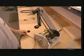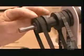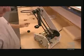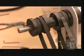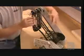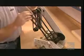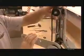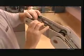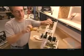At the arm shoulder level, they install a system of 4 pulleys. Each consists of 2 plastic wheels on a separate axle, with a rubber belt running between them like a clothesline. The belt has little teeth that grip grooves on the wheels. It rotates the wheels, making the robotic arm move. Each joint in the robotic arm is capable of and programmed for a specific range of movement. Like the human arm, the combination of these movements manipulates the end effector.